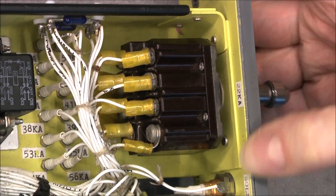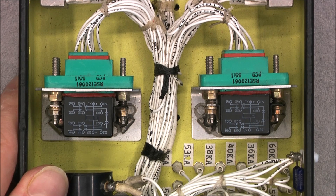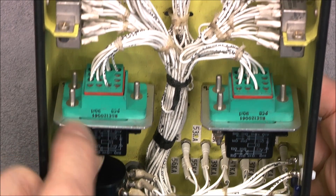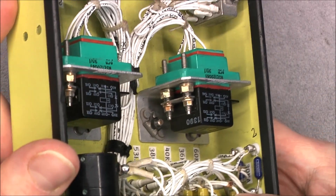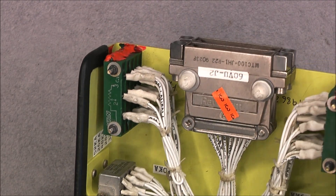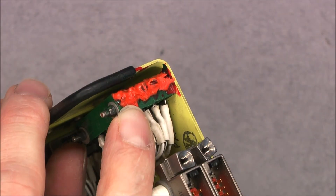It is interesting to note the wires are screwed in. Apart from that we have two resistors here, and relays mounted onto sockets. I'm not sure why there are 3D parts here which are not used — quite interesting. You can see the engineered construction for the brackets with secured captive nuts. More relays here, four of them. On each side we have five trim pots, by VRN apparently, which are secured with orange compound.